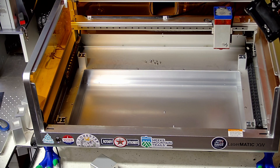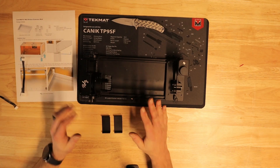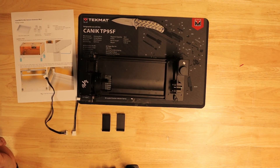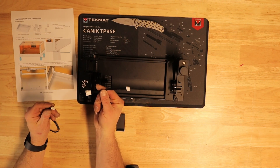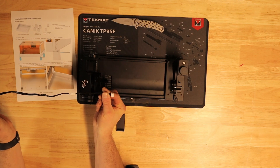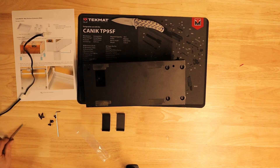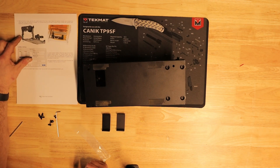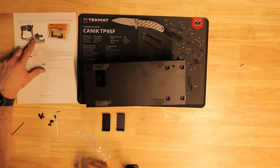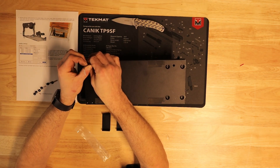The drop down is in place and it works with my Velociraptor feet — very happy about that. Now the next step is to install the risers on the rotary that will allow us to do larger items. We have our original rotary, our two risers, and two pieces of stepper motor cable. What comes with the drop down kit is this extension cable — plug it in like this, and that gives us the added length to reach the rotary's new position. Here's our owner's manual showing us how to install the risers and put in the original four screws.